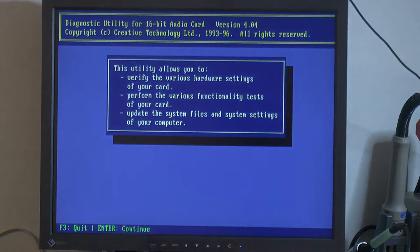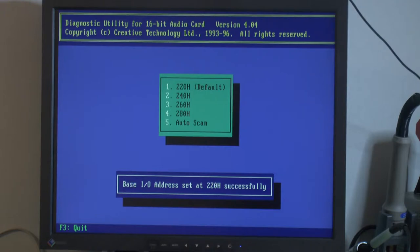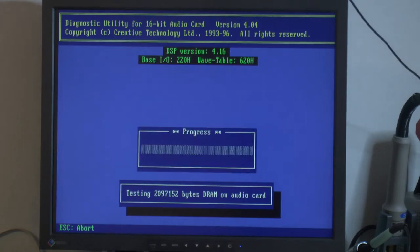And the Russian guy did the same thing, and there's a built-in memory test here, which is convenient. Now, since we replaced the chip, we can see if it's detected and we can make sure it works. I suppose the test writes to it and reads it back and checks if it's correct. Yeah, we detected 2MByte here. So now the test is running. So good we saw the memory at least. Let's just hope it's not dead. I haven't tested that stick to begin with, which probably I should do, but yeah.